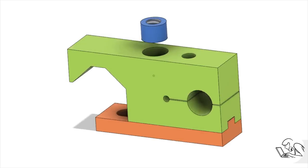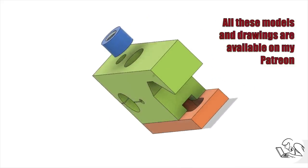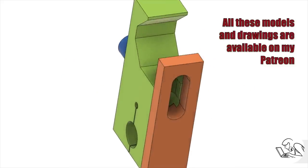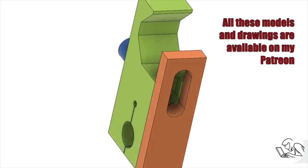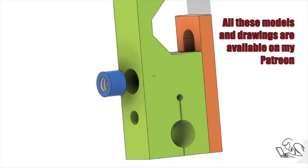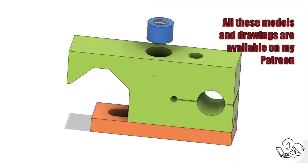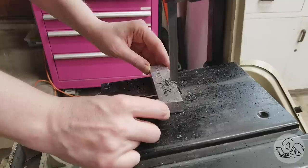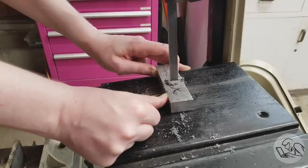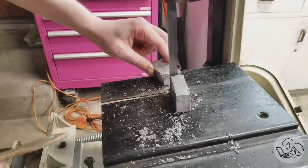I took the model I used for the 3D printed one and modified it for machining. It's still basically a two-piece design — a green hook feature that goes over the ways, and an orange clamping bit on the bottom. There are a number of optional features in the machinable version that I'll talk through as we build it. I've got a scrap of 6061 aluminum I think I can get all the parts out of, so I'm going to the bandsaw — I've got my 4x6 bandsaw set up in the better-than-nothing vertical mode.